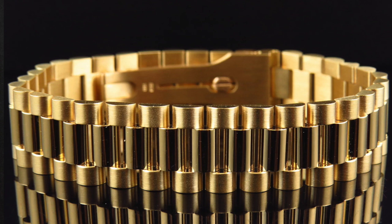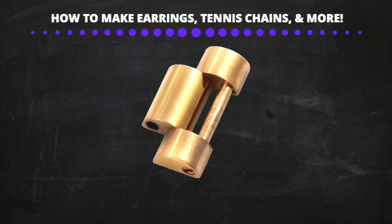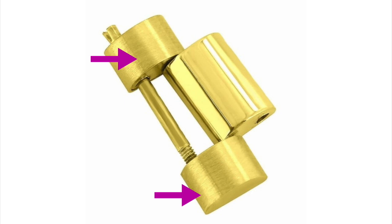A lot of you ask how to make Rolex president bracelets. It's very simple. Looking on eBay, these weigh around 60 grams and cost around $2,000 to make, selling for $5K. You'll have your 3D designer make three files: a bottom link with two pins (solid, no screws), a middle link with two holes, and a last link with two holes but solid on top. You'll also get a clasp file made on cgtrader.com. Print the links with castable resin, cast them at $1.50 per gram on top of spot price, polish the bottom and top links matte and the middle links shiny. The polisher then puts the middle parts on the pins, adds a small piece of solder on each pin, and puts the top link on — that's it.